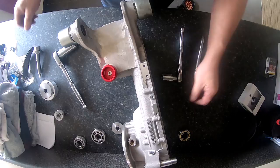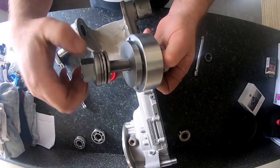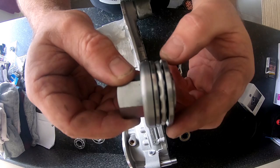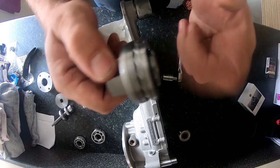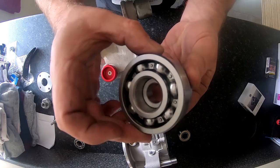I was asked to make a video to explain how this works. It's used for putting your bearings in and taking them back out again — it makes life much easier. That's got a bearing on it which makes it easy to turn even when it's tight, which is really useful. Each of these have got a shoulder on them which rests inside the bearing and holds it in line.